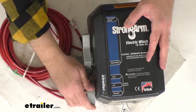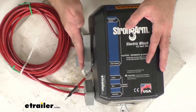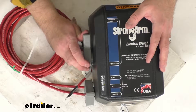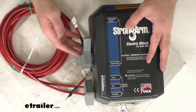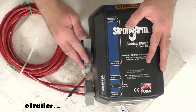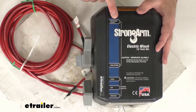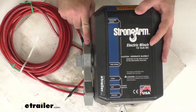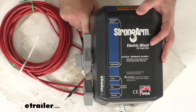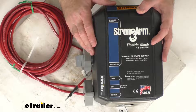The positions are: load, then off, then unload. This is going to be our clutch lever — it's spring loaded. This is going to allow you to load without power, giving you smooth load control from locked or free wheel position. Currently it's in the engaged or locked position, but when I switch it that way it's going to be in the free wheel. When you begin to move it back to the engaged or locked position, it's spring loaded so it'll spring back into the engaged position.